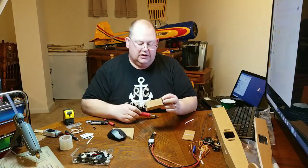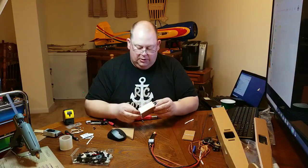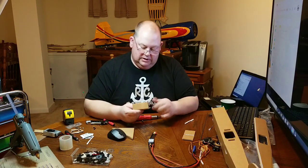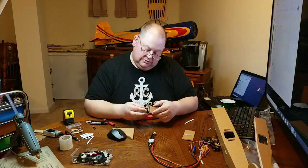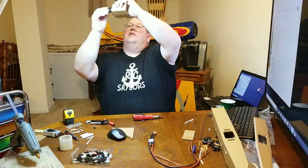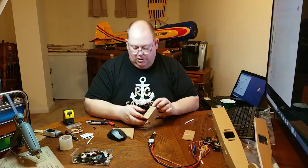He mentions in his video that the number one reason for messing motors up, at least in their warranty department, is the screws going through and hitting the coils of the motor. And I can see down through here that it's nowhere close. And that one's good too. So no problem. Motor's on there and it's solid. So that's the power pod.